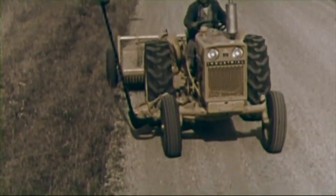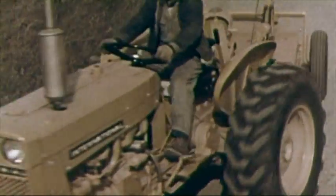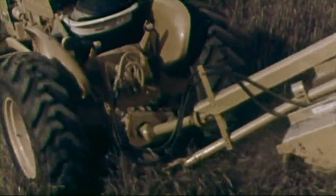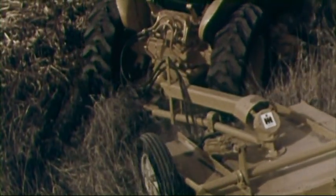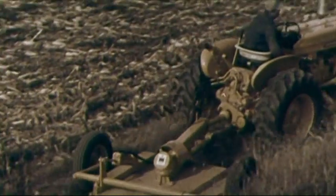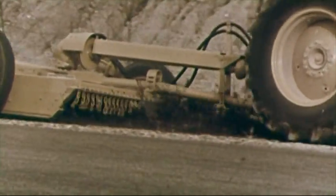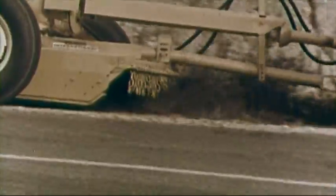The 211 is not as big or heavy as the big 410 you just saw cutting heavy brush, but pound for pound, it has the same strength, the same structural design, the same housing design, the same shielded three-knuckled PTO for easy turning. All the same features and careful design. The 211 can be equipped with safety chains for jobs where thrown material may cause injury, such as grass cutting along roadways.